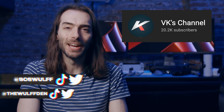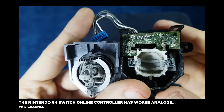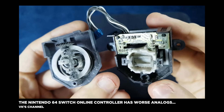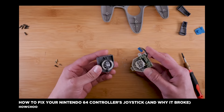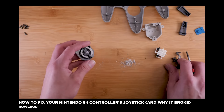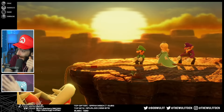Before diving in, I tried to find some teardowns on this new N64 controller and I ran across VK's channel — the guy who posted about that Joy-Con drift fix a couple months ago. He's back to let us know that this thumbstick might actually be worse than the original N64 thumbstick. The original N64 controller stick box is made from a really weak and brittle plastic, so over time it wears down — that's where all the white powder comes from. Games like Mario Party are notorious for making you rotate the stick vigorously.